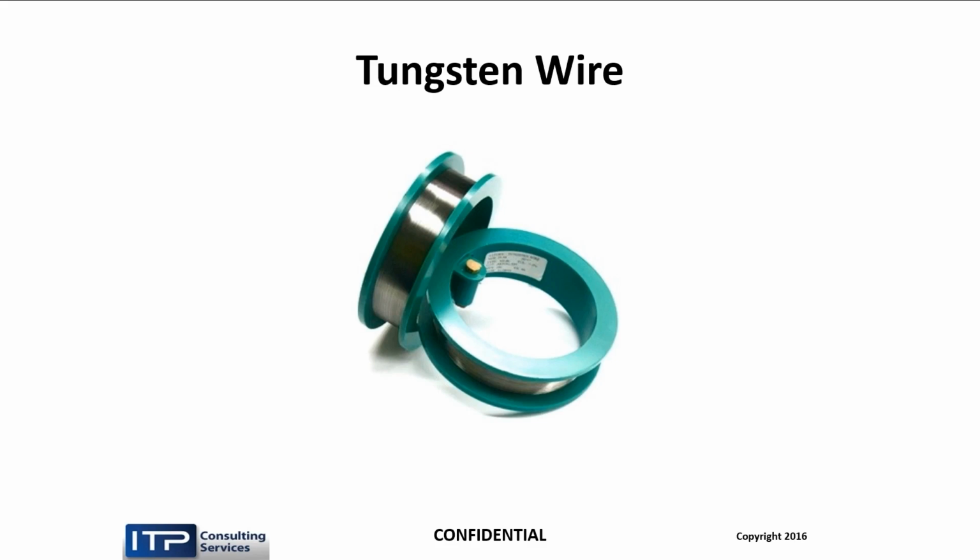But tungsten is stronger and has a higher melting point than moly, and therefore it is used from 2/1000ths all the way down to 6/10ths. I've worked with 1/1000ths wire. I wouldn't want to work with 6/10ths wire, but it is made and it is available. It has all the disadvantages of moly: high cost, slow cutting speed, poor quality, short shelf life. Plus the fact, again, it also eats the lower guides. Now, when you're using small wires to get around that, you just take out the lower carbide because you don't need that much contact. There's very little current going through the wire. So the standard trick is remove the lower power feed.